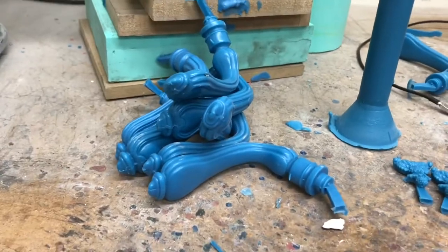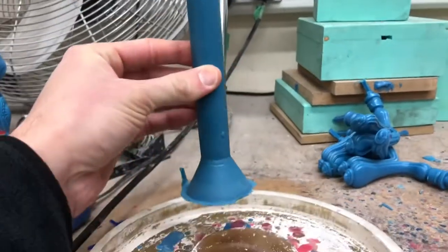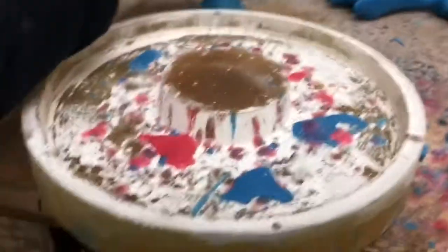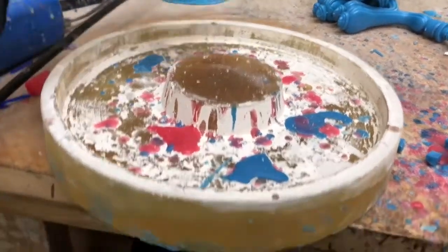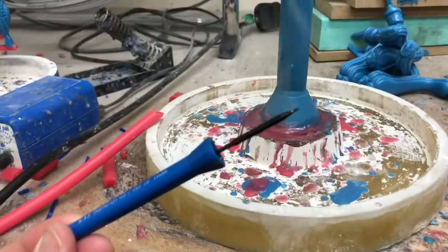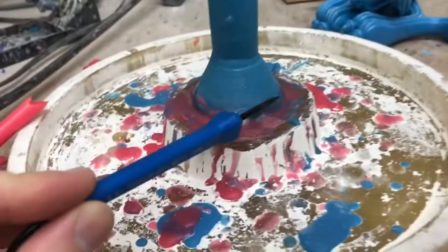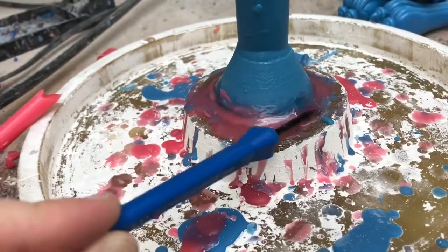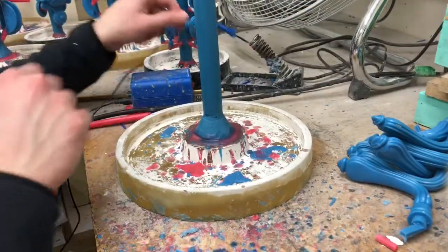Our wax castings are all prepared and ready to go. This here is a stick of wax that I have made — we call this a tree, I'll explain why in a minute. This is the rubber base that the tree goes on to. This is the soldering iron that I use to melt wax to stick the tree onto the base — I'll use it like so to melt wax around the side, and it acts like glue.